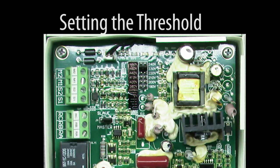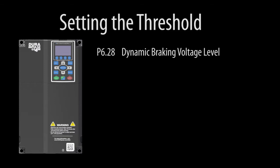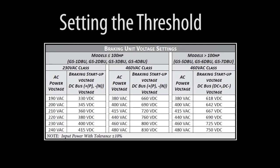You have to tell the DBU at what voltage it needs to brake or dump energy into the braking resistor. On the external DBUs, there is a jumper. For example, on a 230 VAC system, if the line normally sees 220 VAC but fluctuates up to 228 regularly, set the jumper just above 228 at 230 VAC so those normal fluctuations don't enable braking. On drives with braking built in, you set the voltage via parameters using the same guideline – set it a little higher than the line fluctuations you normally expect. You can also use the table in the DBU user manual to set the jumper based on DC bus measurements; for example, for braking enabled over 400 VDC, set the jumper or parameter to the 230 VAC setting.